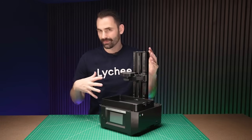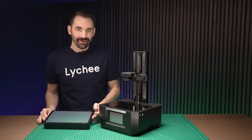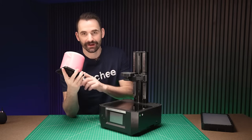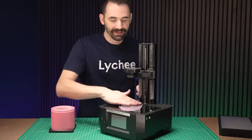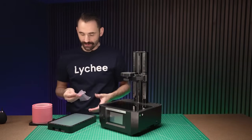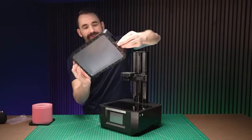Step three works for a brand new printer or one that's been sitting around. You don't want hair or dust on the bottom of the release film or on the LCD. Instead of blowing it off, I use these dental office sticky pads — you just put them down on the LCD and pull up. That picks up any dust, hair, or anything like that. I do this any time I remove my vat, on the LCD and on the bottom of the vat. It also works great before installing a screen protector, to make sure the surface is completely clean.